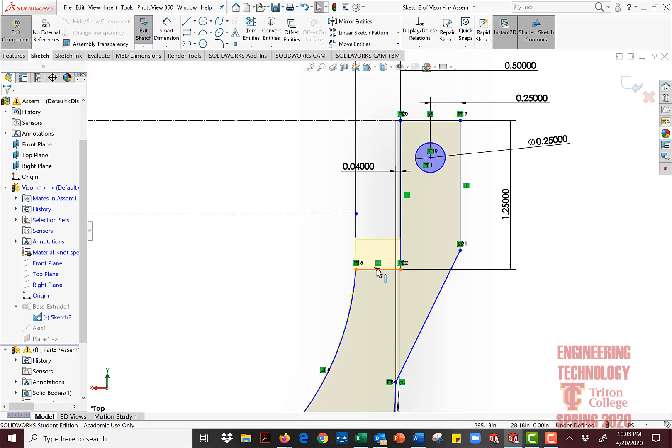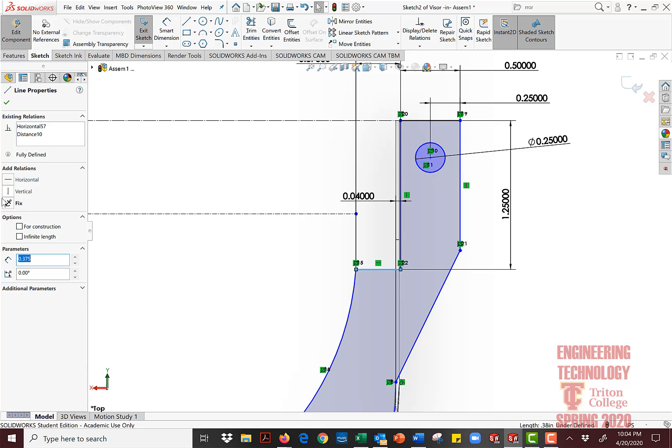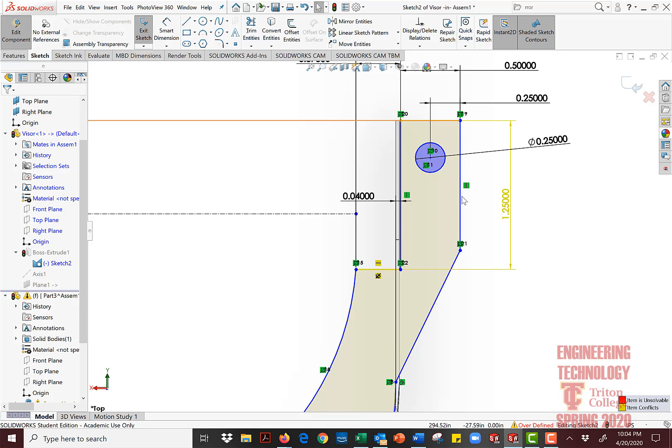This piece we want to leave where it is. The piece that moved wasn't this piece down — it was this piece up because I have this piece locked in. It's got a fix on it. So I undo that fix, click on the item that I would like to fix, and fix that guy. Of course, I get an error message. Anytime you get what I call 'mustard,' you're getting that because this dimension was fighting this constraint.